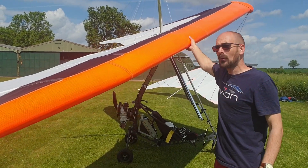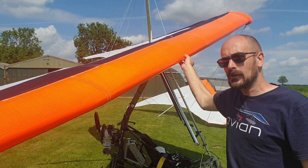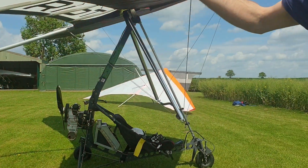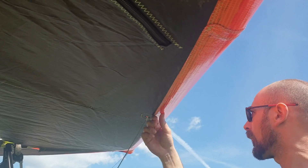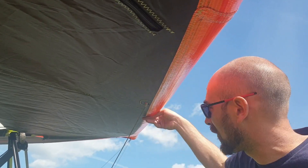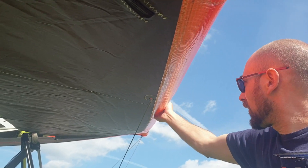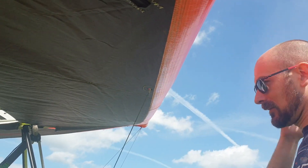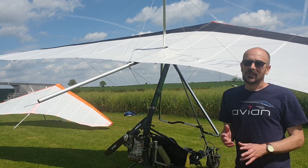Working out how these panels join together would be near impossible, because these are cut as flat panels which when stitched pull the fabric together to create the shape — it would be next to impossible if you weren't designing it this way. It's also cleaned up the surface quite a lot. We're no longer making this using a French seam — almost all hang gliders and trike wings use a French seam — but it adds quite a lot of bulk. With this we've made it a double lap seam, which creates a much smoother under surface, and the smoother you can get the underside the better the flow over it.